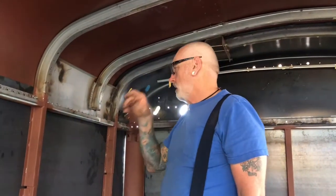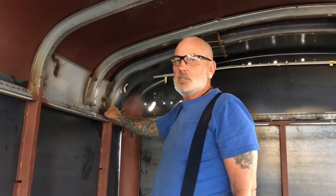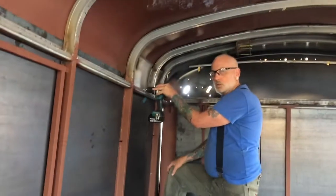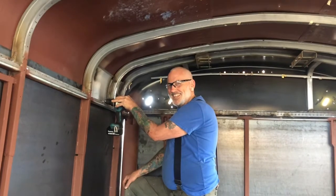So we got them pinned on with bolts instead of clecos because the sheet was too heavy for clecos to hold. So, see, we've got all the ribs chalked off and pre-drilled. I got it laid out for you. You can do the bottom on your stool. Yes. You can sit down on the job. I can sit down on the job.